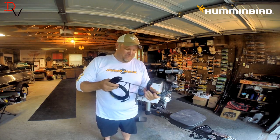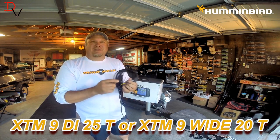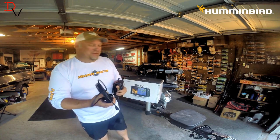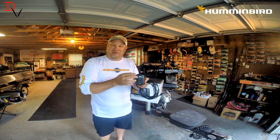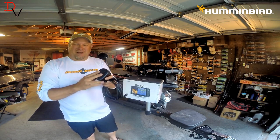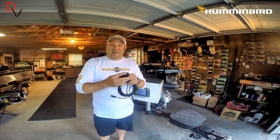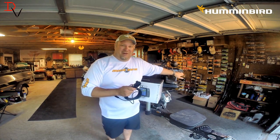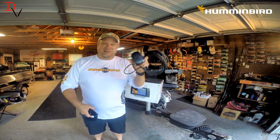If you look on the cable, there are actually going to be two different versions. It's going to say XTM. There is the XTM 925 DI and then there is the 920. The 920 is what we call wide because it has a dual beam 2D sonar crystal that allows it to do 283 kilohertz — the 200 is a 20 degree cone and the 83 is a 60 degree cone. Down imaging is 455 and 800 kilohertz. The 925 transducer is 455 and 800 for down imaging and 25 degree for 200 kilohertz. Get the wide version if you want wider 2D sonar coverage, or get the XTM 925 if you want the standard version.